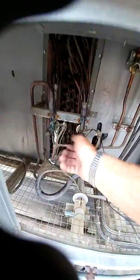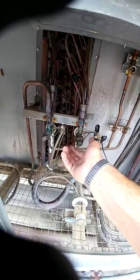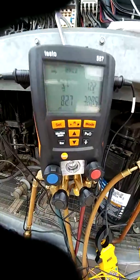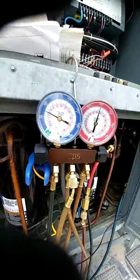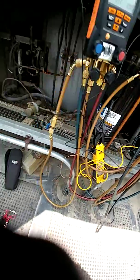TXVs — you can adjust these ones, they got the nuts. I did a little adjustment on circuit 2 when we put the new compressor in, and that's what you're seeing right there. That one's running great. This one's running like shit. But that's how you diagnose non-condensibles — you watch your high side.